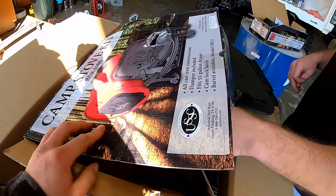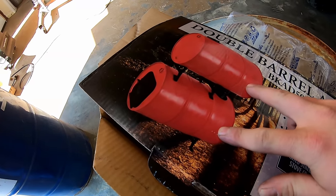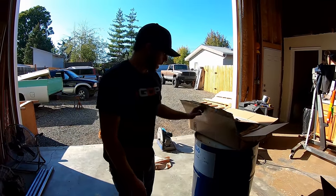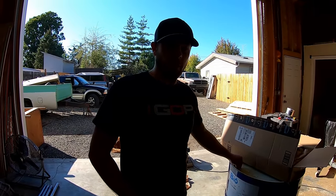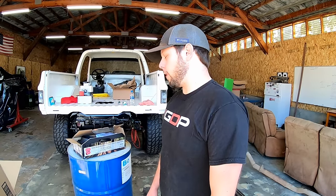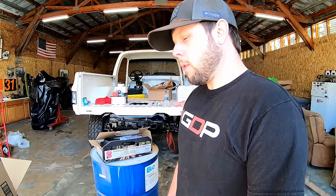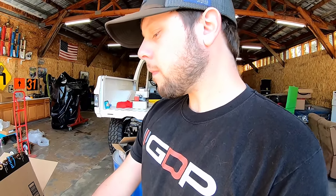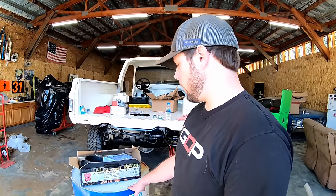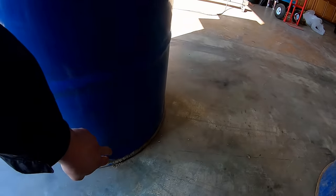Some people will just run the two barrels without modification, but we are going to be adding pipes through here and then a fan on the back, and that will help take some of the heat and blow it out the front. It should pull a lot of heat out of the barrel — get almost as much as we can. Barrel stoves aren't exactly the most efficient way to burn wood, but when you need to heat a big area you can get these really hot. So we're going to do the bottom barrel first — put the legs on, get the door on, cut a hole for the chimney to connect the two barrels.